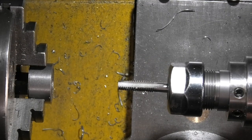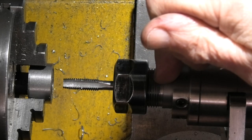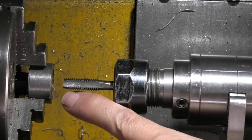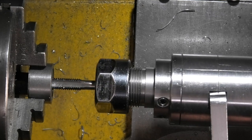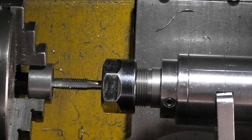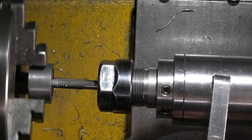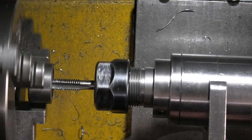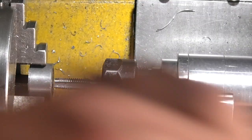That's the finished part — we're nearly finished. All I have to do is add three dimples where the grub screws go. I've tightened the 8mm tap. I've fitted the collet holder in my die stock and I've drilled a hole in there for an 8mm thread. So now I want to see whether this will work. If I let go it turns freely.